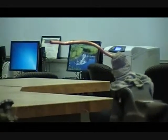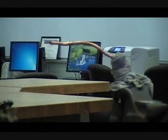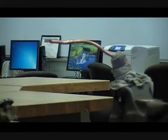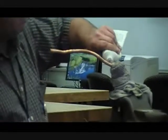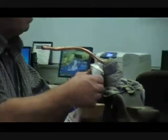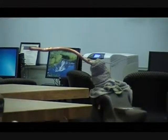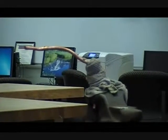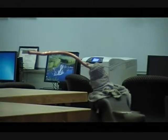I could also use heat block, but let me say this: once you put heat block on and it gets into a place that you need to solder or braze, you're in trouble. I don't know exactly what it is, but it gets down into the metal pores and I've had a lot of difficulty cleaning it up if it got into a joint area. So yes, you can use it — and I'll put a little bit here — but most times the wet rag is the main go-to. I'm using both here, and that's fine, but you definitely don't want to get heat block on what you're trying to put together.